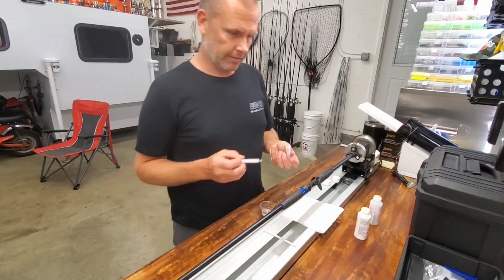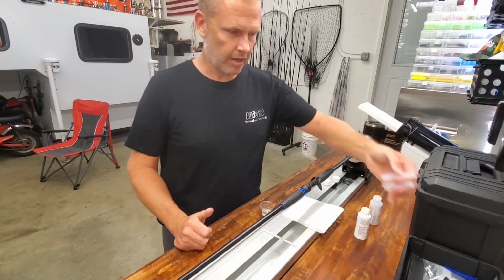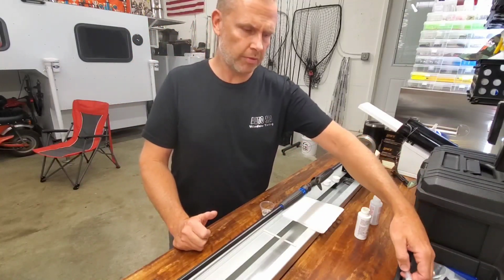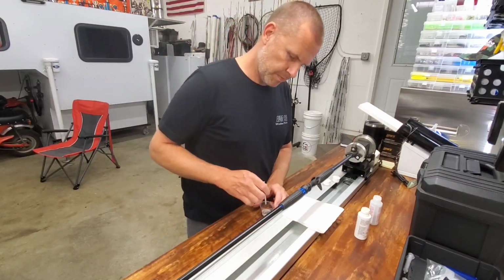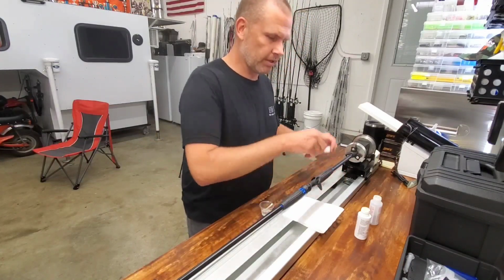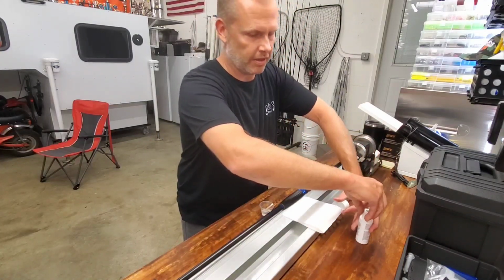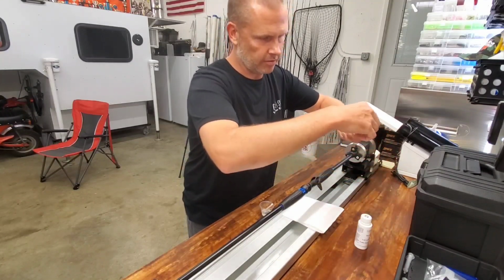Yeah, don't be a tightwad. Spend the extra for some epoxy syringes. Apparently it's important that you avoid regular syringes that might have silicone in them and get some designed for this purpose. I just don't see another way to really feel confident that you got a correct ratio without those syringes. So I think they're worth the money.